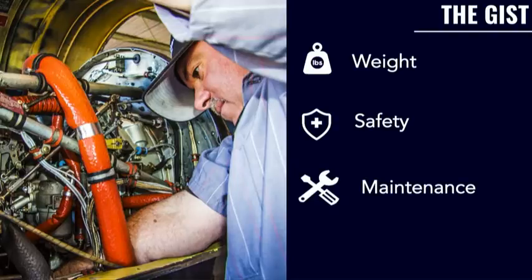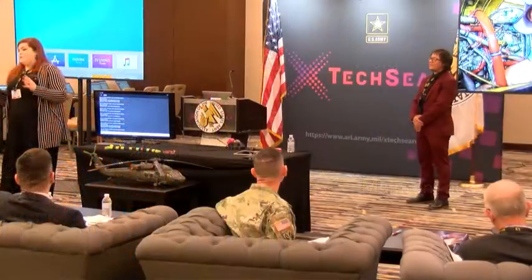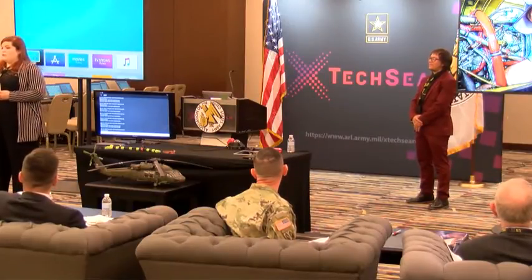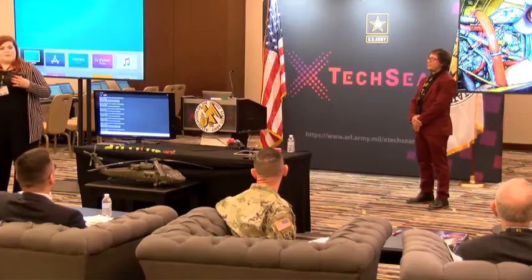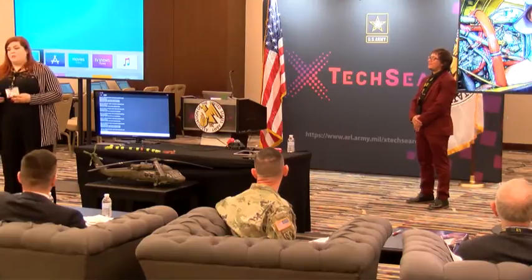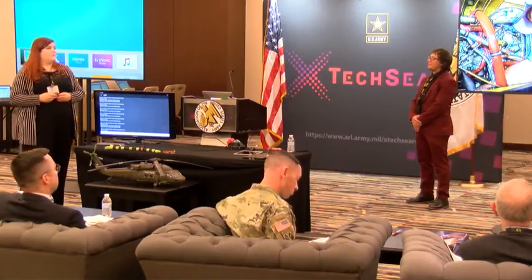And in regards to maintenance, these clamps are very difficult to install. They require between 4 to 7 additional pieces of hardware. I know there's some aviators here, so you may have seen them around. And they're very difficult to reach in certain areas. And when you have to do this setup, if you drop something, everything needs to stop. You need to find where it is because of FOD. And when you have to monitor the electrical system, currently there's no method that can really help you localize and pre-diagnose faults within the wire. And you have between 2 miles to 45 miles of wiring in some aircraft.